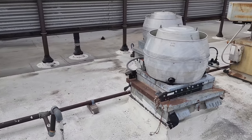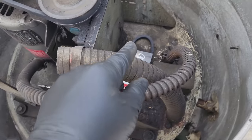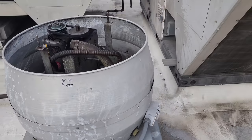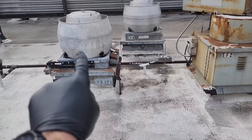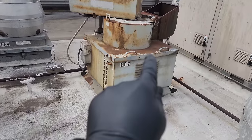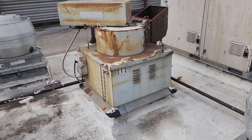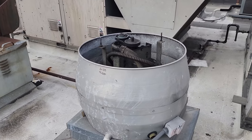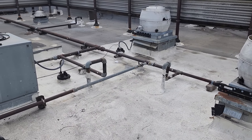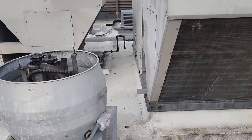We've got new belts and spare belts in every exhaust fan. The spares are left in a place where they're not going to cause damage or get stuck in the wheel — put on the back, nice and good. Everything's tensioned, so this unit's ready to get turned back on and the lid put back on. The customer is going to be happy because their original problem of a broken belt on that single exhaust fan is fixed. But I was also able to look at everything and identify additional issues to bring to their attention.